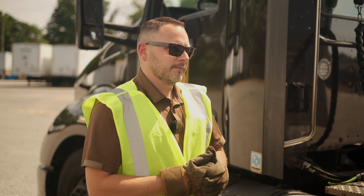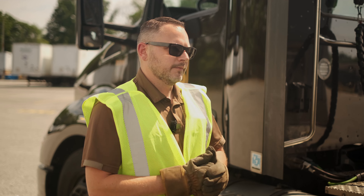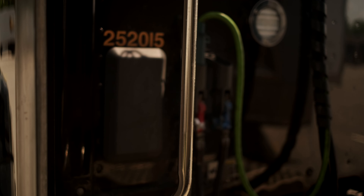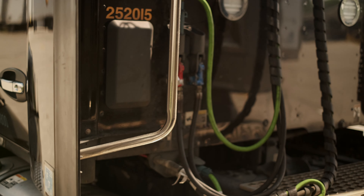Take your glad hands off, put them in the proper mount. Light cord out, put it in the mount. Don't put them on the deck plate — what could happen is they'll dangle, fall, get ripped off. Now you've got issues that you could have prevented.